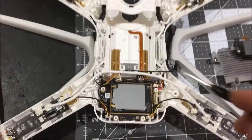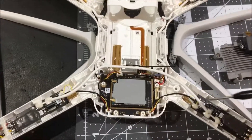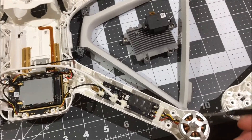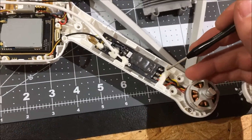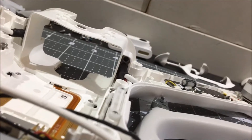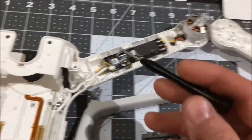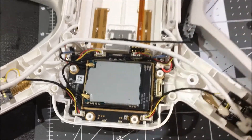The next step to get everything over is to get the legs off and get those disconnected, then pull this over. After that it's going to be the ESCs and the motors. The other videos show you how to take the plates off on the bottom — you undo the motors and they pop off, no biggie. All this is kind of hot glued in, so you're going to have to do a little bit of cutting with a razor knife. All the wires pop off — they've got a daisy-chained, pretty nice neat-looking wiring job. Got a couple of connectors back here with little Phillips screws that hold them in. We'll pop those out and basically lift everything off; at that point everything disconnects plug-wise from the boards.